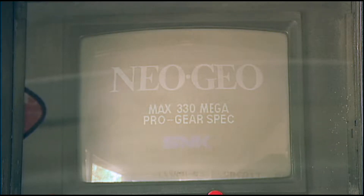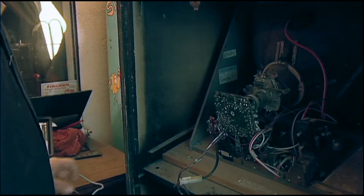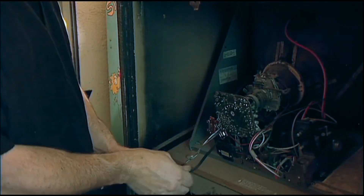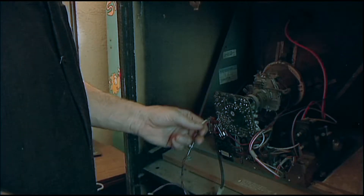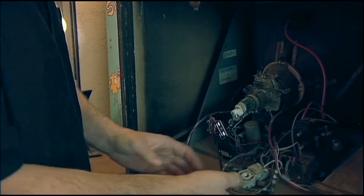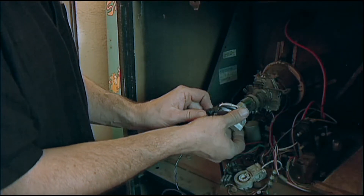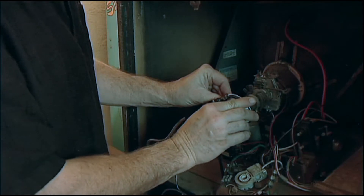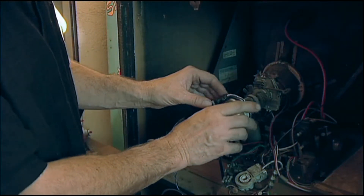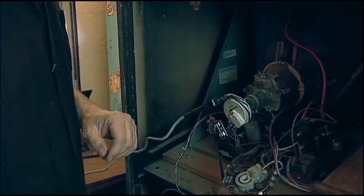The picture doesn't really look washed out, so you have a nice black level on the screen. This definitely looks really weak, so I'm going to throw the rejuvenator on there and see if we can improve the emissions on this. First thing I'm going to do is disconnect the AC to the monitor, carefully pull off the neck board, and then attach our socket. I've never had to discharge the anode cable when rejuvenating these — it's never been a problem for the tester that I use.